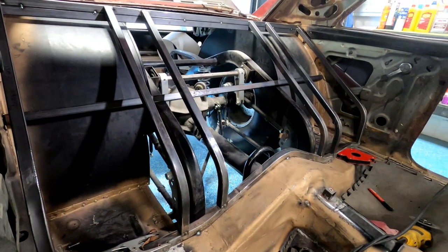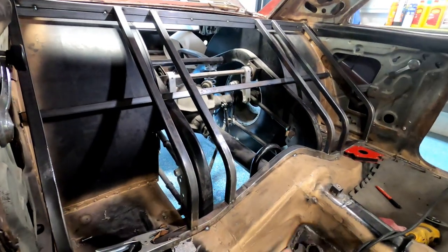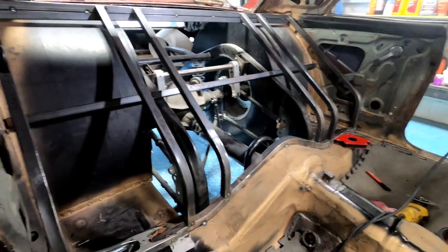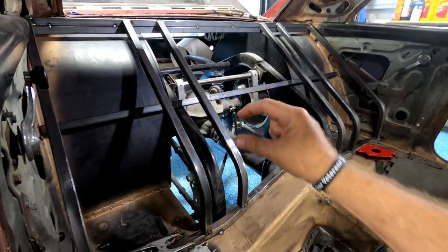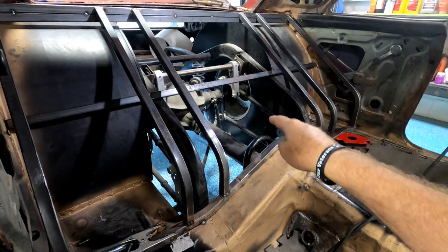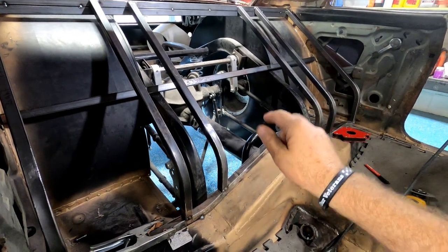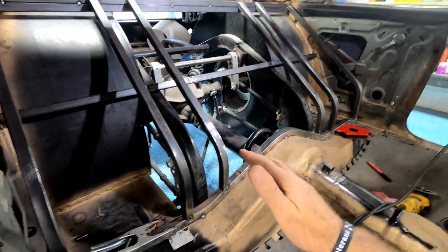Hoosier has a 33 by 22.5 by 15 tire as well. Not a problem, went with that. Don't mind that. Clearances might be a little bit different. And when I say that, the back of the tire, I have 1 inch of clearance. Now, when I do a burnout, that tire is going to grow, and I don't know how much. I've talked to Jeg's so far. He's kind of, I don't know. But we can't find any information.